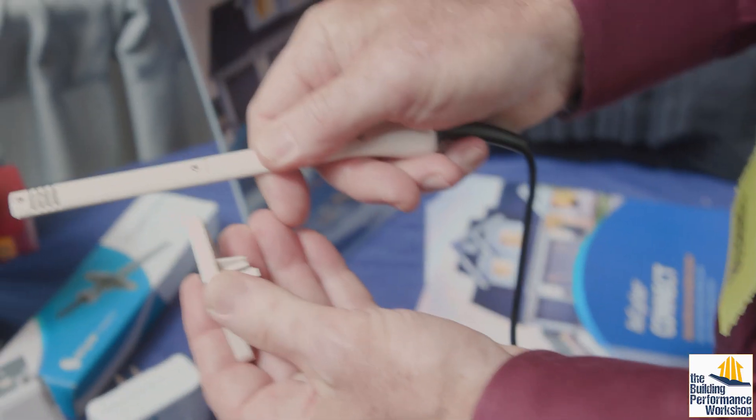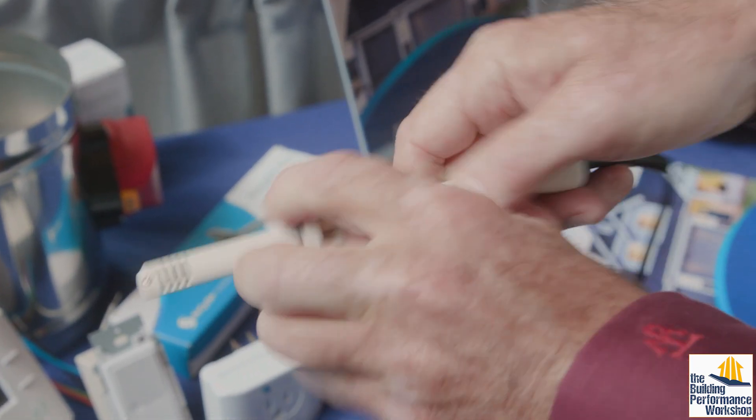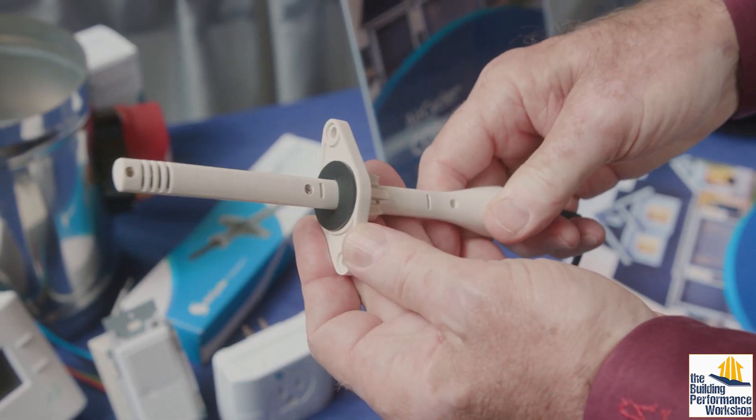This is a temperature, humidity, and airflow probe — basically a hot-wire anemometer. Because the temperature in the duct may be closer to the basement temperature, you let it run for a couple of minutes to bring in outside air before taking a temperature reading, then start measuring flow in CFM going into the air handler for proper ventilation. The real beauty is that if CFM starts to drop, you can determine the filter is clogged — set a flow rate threshold in the app and it'll send you a text or email. As we talk about disasters on season 3 of Home Diagnosis, we're also talking about resilience, and this ability to adapt how homes are acting is incredibly important given different climate zones, housing types, occupants, and behaviors.